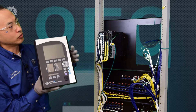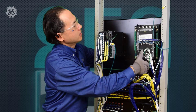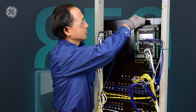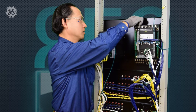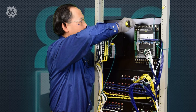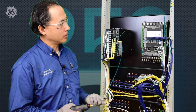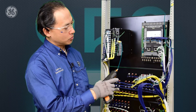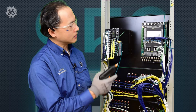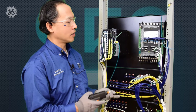This is the 859 we're going to put in the rack with the same cutout. First, we put on the mounting screws. Once the screws are back on the mounting rack, we're going to do the rewiring. First, I'm going to wire in the bottom CT/VT inputs, then the top output relays and the control power, then plug in the RTD terminals, digital inputs, communication ports, and analog outputs.